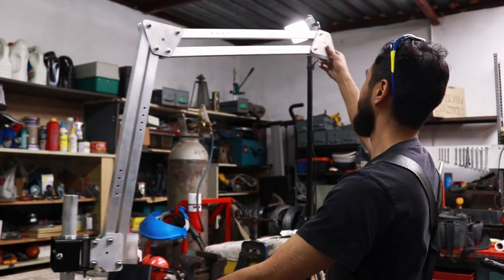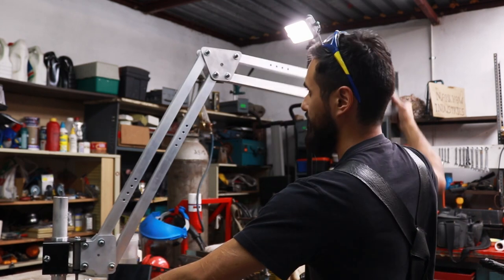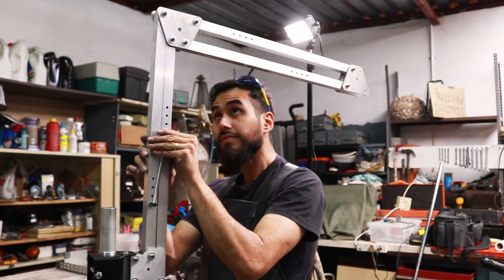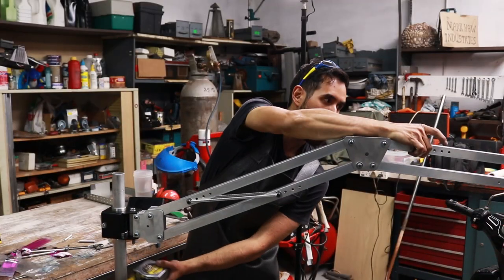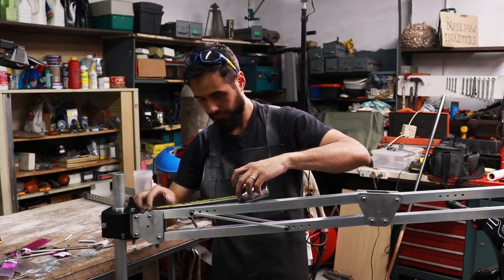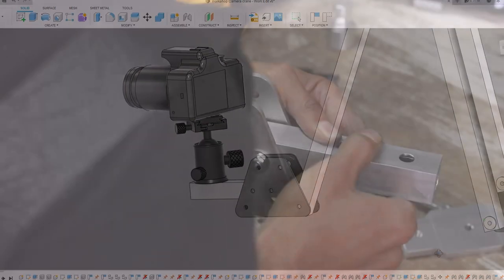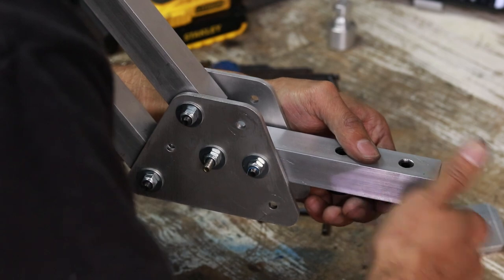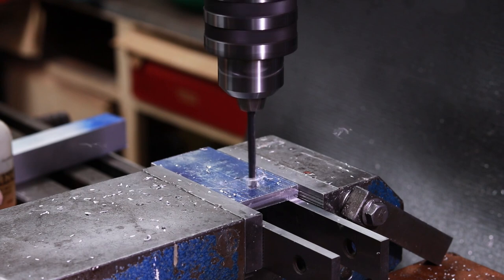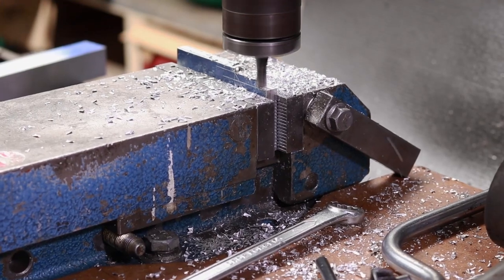I am stoked — look at this thing! Now just to add the springs. The springs are really just to counteract the weight of the camera, and in conjunction with the friction of the washers and plates they can keep it in place once you've moved it into position. Now we're going to make the actual camera mount — for that we just need two more of these bushings. Then we make the actual mounting plate back on the mill: just some tapped and drilled holes and a nice little corner chamfer, and it's all ready to be put on.